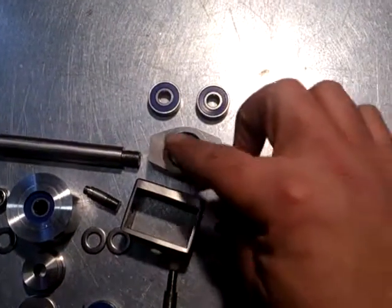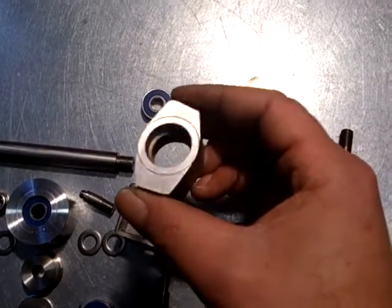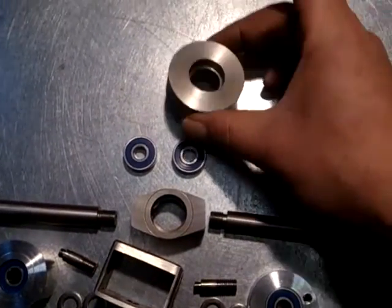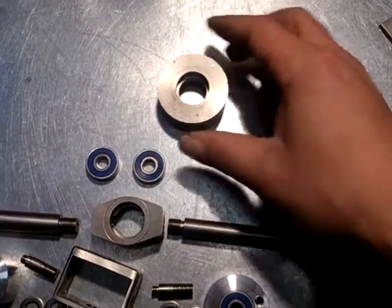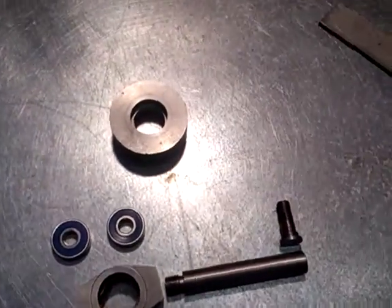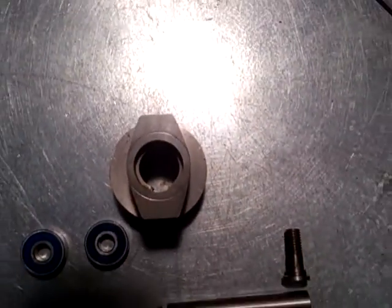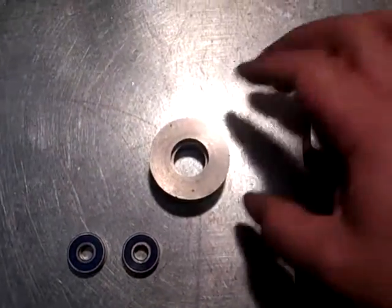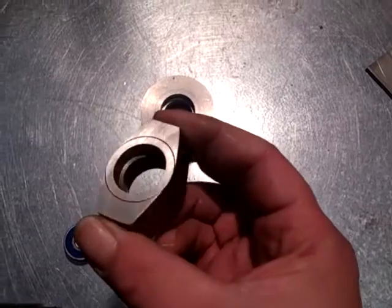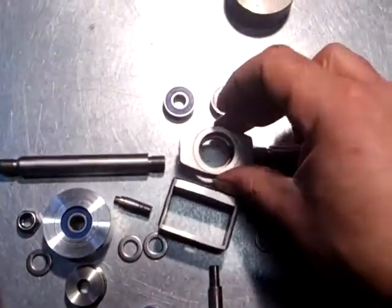This piece — I really like this piece. This is stainless steel; it's quite a lump actually. This was originally machined by my dad from a 50 to 60mm stainless steel billet — and dad kindly made me a spare as well. As you can see, you can see the registers where the twin bearings drop in, so there's a bearing that runs in either side of that. Not much chance of that wearing out. Basically we start with a 50mm round billet, then using a grinder, a belt and table sander, and a mill to flatten the edges off, we shaved it down into what you can see there — considerably smaller and considerably lighter.